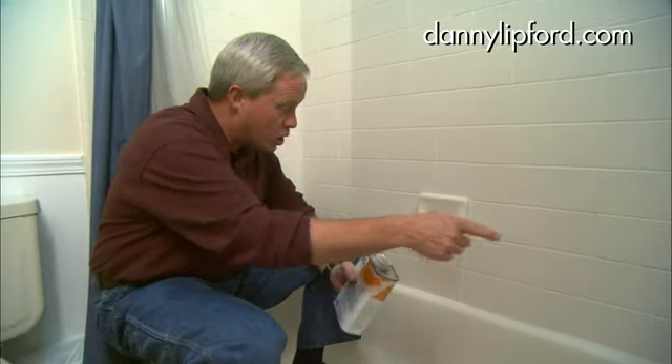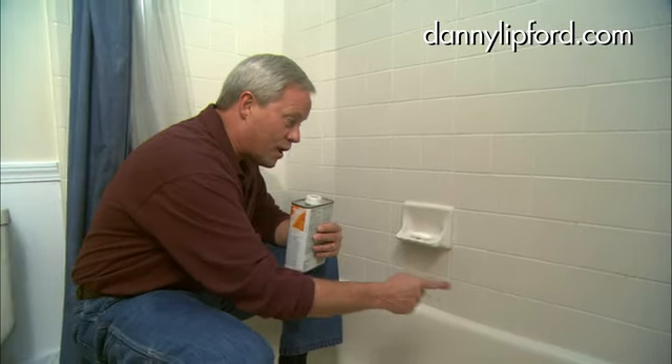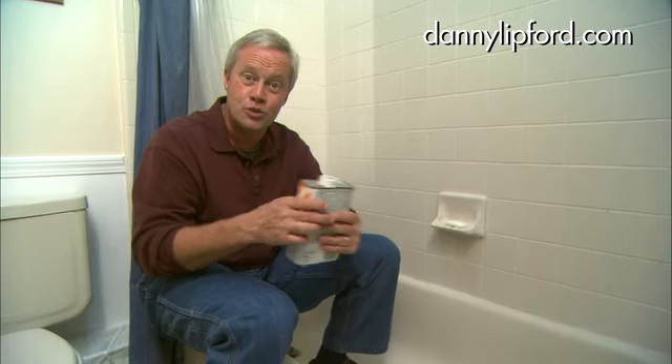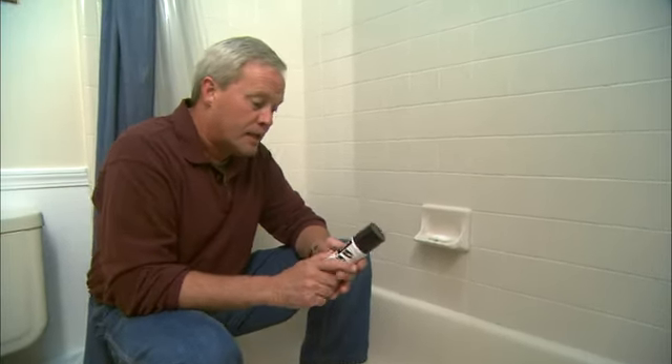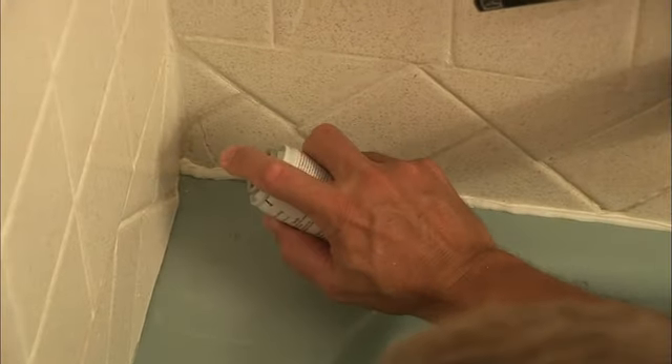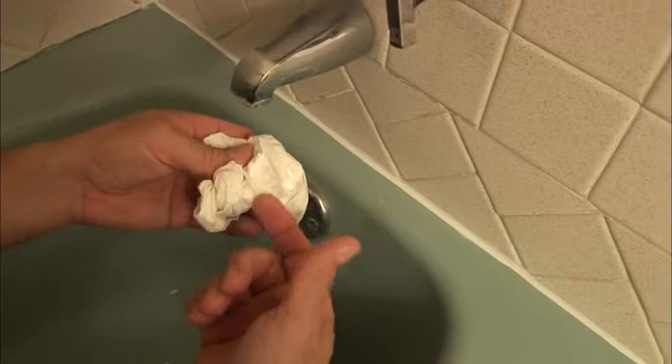What you can use is just mineral spirits. After you apply a small bead of caulk, put your finger in the mineral spirits and wipe it nice and smooth. But then you have the smell of mineral spirits on your finger. Here's something we found recently — it's called Caulk Easy. After you apply your thin bead of caulk, you just spray this over all of the caulk and it allows you to get a nice, smooth finish without any of it staying on your finger. Even if a little gets on your finger, you can wipe it off very easily.